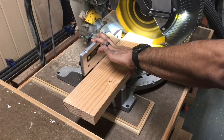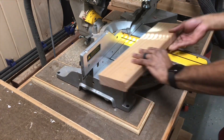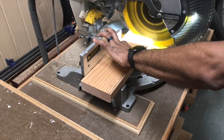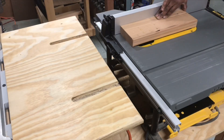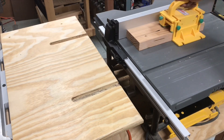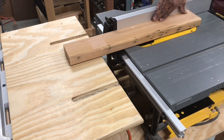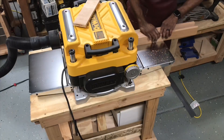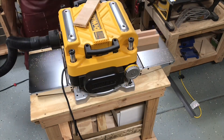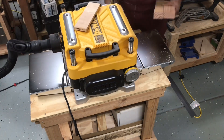For this project I was able to use a couple remnants I had lying around the shop. I started by trimming off the pieces that I wasn't able to use for this build. At the table saw I'll be ripping the pieces to their width. I'll use the planer to make the pieces a little bit more uniform in hopes of smoother operation once the mount is assembled.